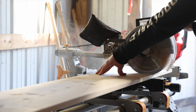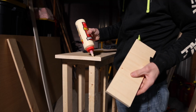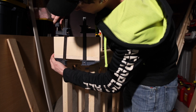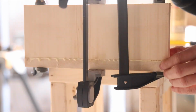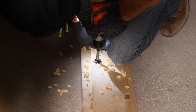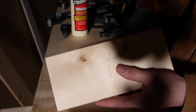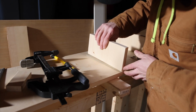In between the framing and plywood step, I started making the mantle so the glue could dry overnight. I used a 1x12 for the top and bottom piece and then 4 vertical supports with enough room in between the two middle ones for whatever you are planning on storing. In my case, it is a soundbar. And for the front piece, I used regular cabinet hinges, which really makes this hidden storage happen. Also, the two middle pieces do not go the full depth to leave room for cables to go around.